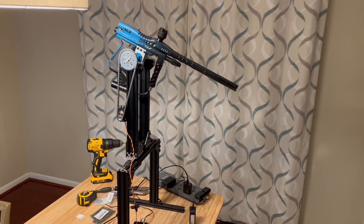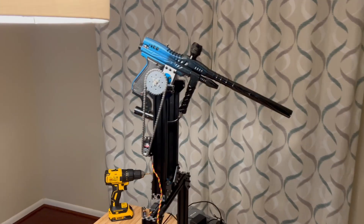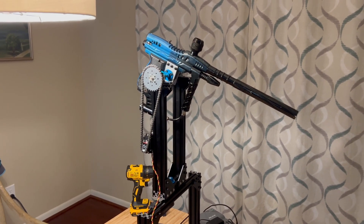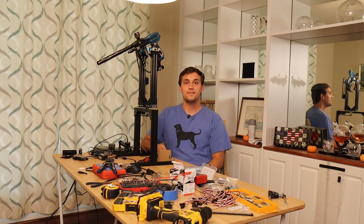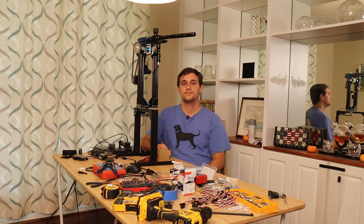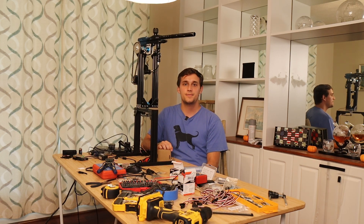Time for assembly. I just got the paintball gun mounted. I ended up choosing a bigger sprocket here just to give the servo a bit more of an advantage since the paintball gun is kind of heavy, and since this thing is going to be moving at some point, I don't want to wear out the gears on the servo too quickly — lesson learned from before. Here's the turret hooked up and moving around. I'm using a servo tester to control it for now, but eventually it's going to be controlled from the Raspberry Pi. Now that all the mechanical parts are ready to go, it's time to start coding. In the next video, I'm going to be working on a smart home surveillance system as well as the targeting system for the turret. Once the code is ready, I'll be conducting some human trials with my friends to see how well my code works. Make sure to subscribe and I'll see you next time.